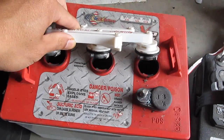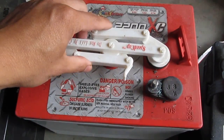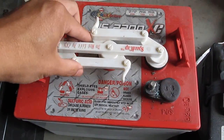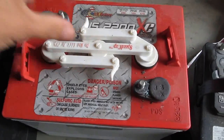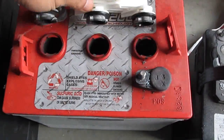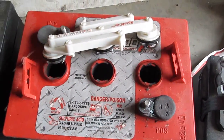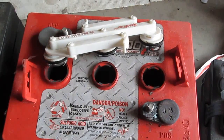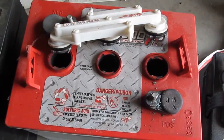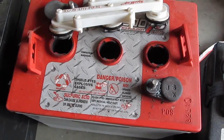This is very important because every time you charge the battery, it will lose some liquid, meaning water. It will bubble up. It's not boiling because it's not 100 degrees Celsius. It's only about 30 something degrees Celsius, 30 or 40 max. If it gets too hot, then your battery is probably dead. It's hot, but it's not that hot.